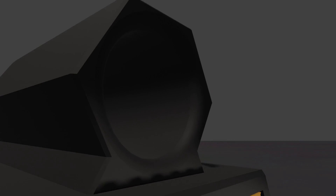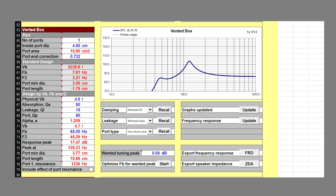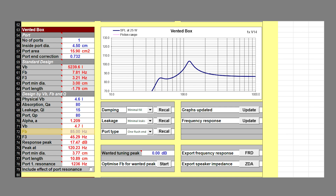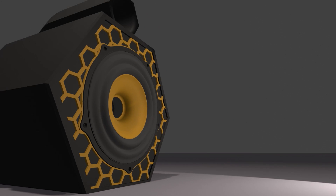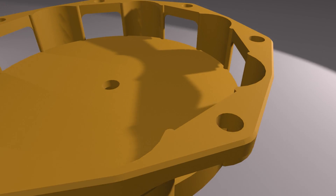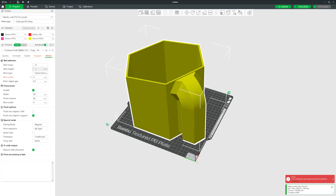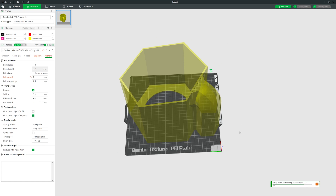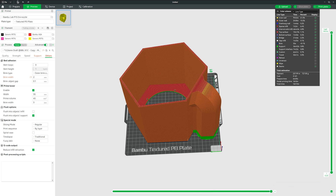Both ends of the port have a tiny flare — I think it's a five millimeter radius on both the internal and external ends. The box has a 4.6 liter internal volume — that's the actual free air space inside with the speaker and everything included. It is tuned to 85 Hz, which is probably a little high. The enclosure is printed in PETG, as are all the non-heat-dependent components — the frame, outer motor basket parts. The enclosure uses approximately 800 grams of filament.